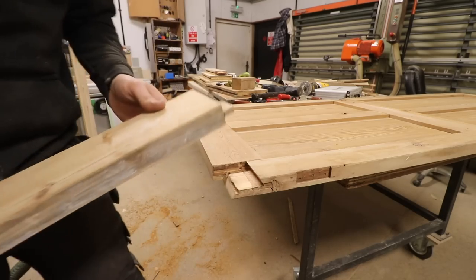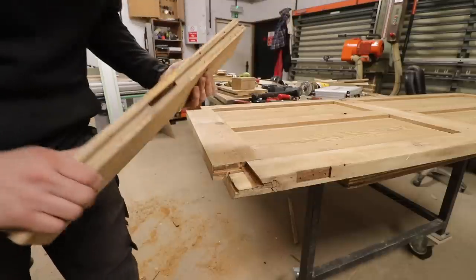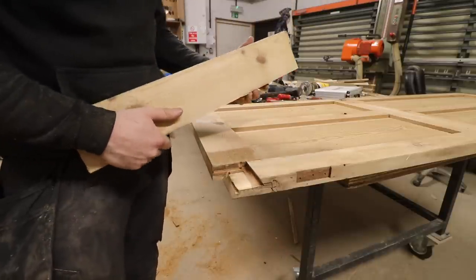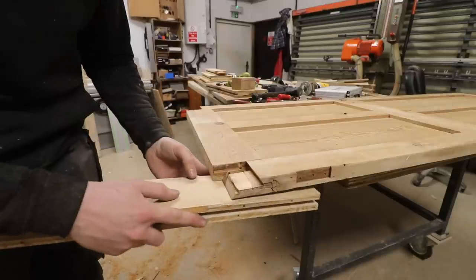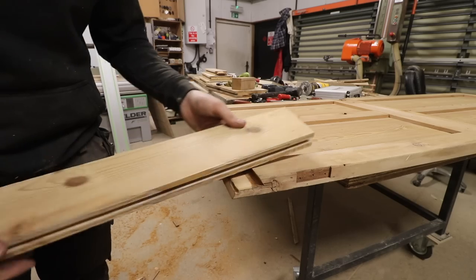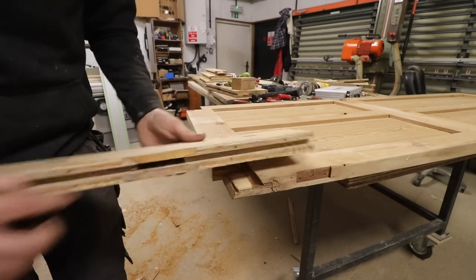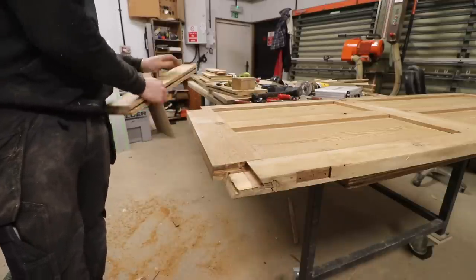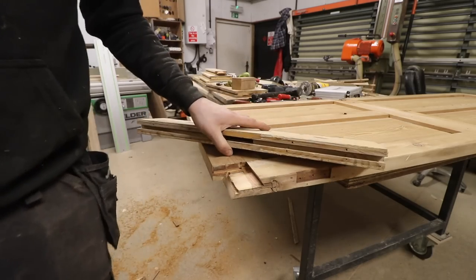Now I just need to select a piece of timber to splice in. I've got some components from another door that was sacrificed for various door repairs — it wasn't a particularly brilliant door, so we're harvesting the timber from it to repair the others. I'm going to try and find a bit of similar grain. That looks pretty decent, and it's one of the shortest bits, so probably the least wastage. If I cut this in half it should nicely do the two sides of the door. I'll cut that down on my crosscut saw.